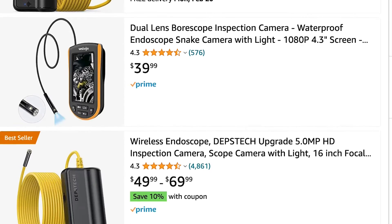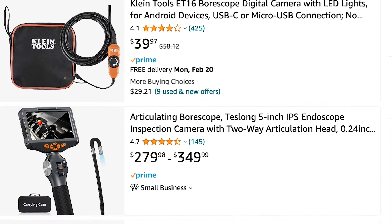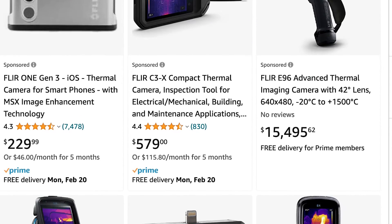Additionally, even before that, a lot of times bee removers — to make sure they give you a realistic estimate of cost — will have specialized tools like a bore scope or a thermal reader. A bore scope serves a very specific purpose: you insert it in a small hole. It's basically a cable camera that allows you to see inside a cavity to get a sense of how long and how big a space is, and to get a sense of the specific location of a beehive in a cavity. Additionally, beekeepers will often use a thermal reader. Bore scopes are typically fairly inexpensive — we're talking like 50 to 100 bucks — but a thermal reader is going to cost much more. A cheap thermal reader you can plug into your phone is about $250. A handheld thermal reader can cost $1,000.